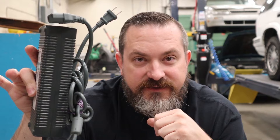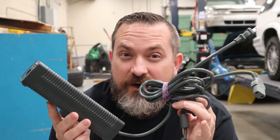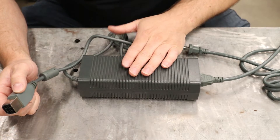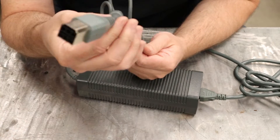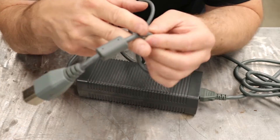If you're looking for a power supply with a little bit more power to it, you can use one of these — a power supply from an Xbox 360. It's an older system now, so you can find these at a thrift store for practically nothing or even free. This one was given to me for free. I'm going to show you how to wire it up so you have a switching or non-switching 12-volt power supply that supplies up to 16.5 amps — tons of power. You leave the AC plug end as-is to plug into the wall, and the end that normally goes to the Xbox 360 we're going to clip off just past that little bulge and see what's inside.